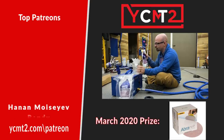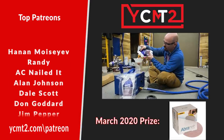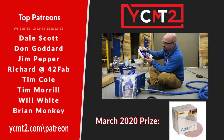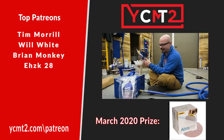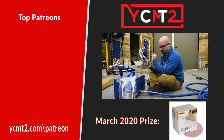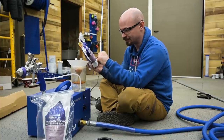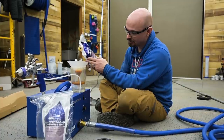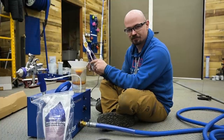Using my go-to finish, Total Boat Halcyon, I'm going to do the first coats with the rugged amber gloss to warm and tone the wood. For the longest time this was only available in gloss, which is the purest form of any finish. Last year they actually added a satin in clear. So I'll build everything in gloss because that's the clearest finish, then top coat with the satin to knock down the sheen some — it's going to look really nice. I like to spray it. Spray is nice and water cleanup. I really try to avoid anything that requires solvents — it's just such a nightmare, not to mention the environmental impact. We'll get the Fuji all set up and spray.